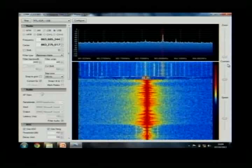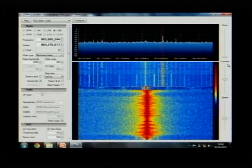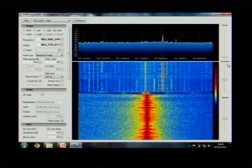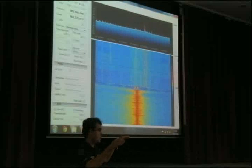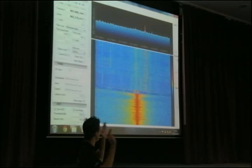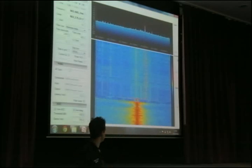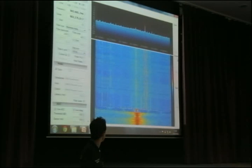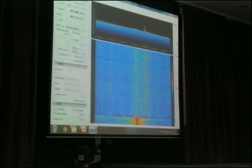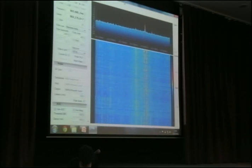So it's dropping samples occasionally, and you get some bad imaging as well. The sensitivity, you can't see it as much here, but the sensitivity actually tails off quite a bit at the ends. So certainly if you're using 3.2, it won't cover the full 3.2, just because the filters in the ADC cut it off a bit at the ends to try and stop ill effects. But there you can see quite a bit of spectrum. As you can see, if I go in there now, as I just did before stopping it, it's grayed out.